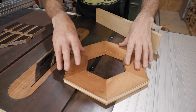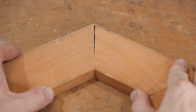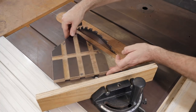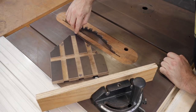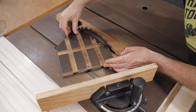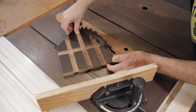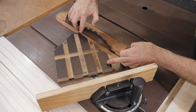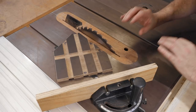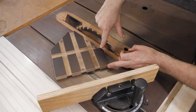It might take a bit of trial and error to get it just right, but put all your pieces together and hold them with a rubber band, tape, or a band clamp. If one of the joints is open at the point, the mitre gauge needs moving to make more of an acute angle, meaning the guide needs a little bit taken off this end. You could do that with a hand plane or sand it, but I would do it with the table saw — set it against the blade, move this end ever so slightly away just a hairline gap, set the fence to that, make the cut, and then redo the whole test. If the joints open on the inside, you need to do the opposite and take a little bit off the other end.